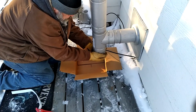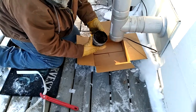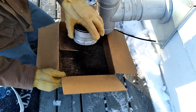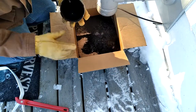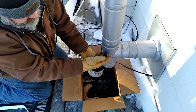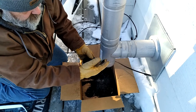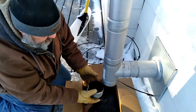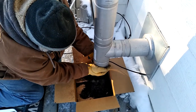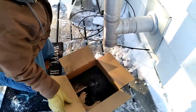Now I got it broke loose, which is probably going to dump out. That was it — the bottom cap was full of ash, so we'll dump that out. You've got to be careful: these are pretty efficient as far as containing debris, but if this fills up and gets higher than the entrance, all the dangerous fumes can back up into the unit, which is going to back up into your house. For safety purposes, this needs to be done every year — preferably before it gets freezing. Look at that, it took less than five minutes. We're safe for yet another season.